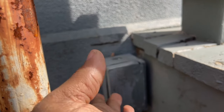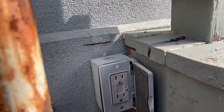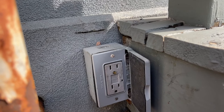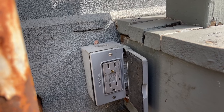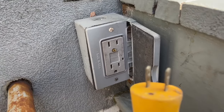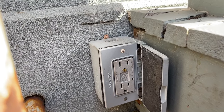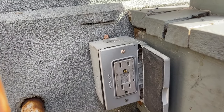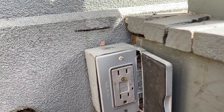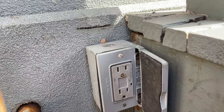Make sure the outlet is designated. Although these outlets may be GFCI protected, there's other lines on that circuit. You don't know how many wires are in that conduit, hence the lack of heat dissipation. I also told him that although they're GFCI protected and there's a breaker at the end in the panel for these outlets, the wires will burn and fuse before the breakers trip. If he's going to continuously charge on a level one charger, he should look at maybe calling me over to install a designated outlet for his level one charger, because there's nothing in the house drawing that type of current for so long. You're talking 50 hours of usage for a full charge, or half that just to get a decent charge with a level one charger.